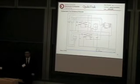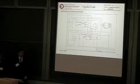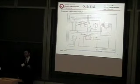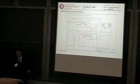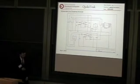The sensors that we're using are Banner Engineering 18 sensors. They're opposed infrared sensors. So they're a paired emitter and receiver that operate at a modulated frequency so that there's no interruption from background noise or from other nearby RF sources or infrared sources.